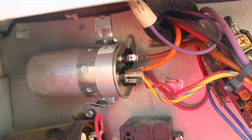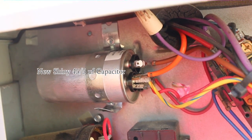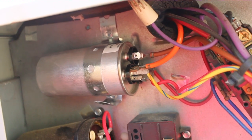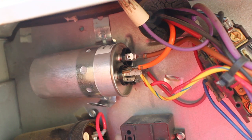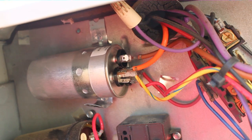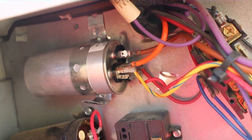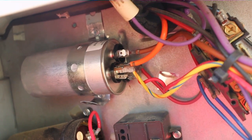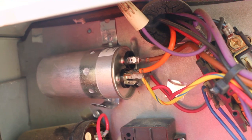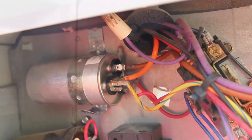I have the new capacitor hung up in place with a little bit of plumber's strap. I was using some inch galvanized strap and drilling holes in it, but I saw a couple of the guys using the plumber's strap — it seemed like an obvious change to make, so I switched over to that. The holes are already in it and you never have to drill your own holes. They're pretty conveniently placed. So it's anchored in place.